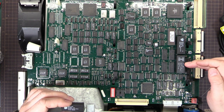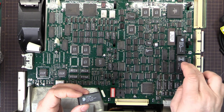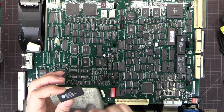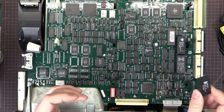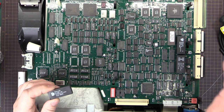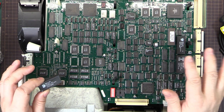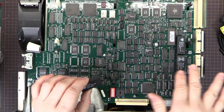Then there's the DS-1650Y — that's just battery-backed SRAM — and the DS-1250Y. The 1250 and 1650 are pin-compatible; the only difference is the 1650 can write-protect individual parts of the memory. I don't think Tektronix scopes use that feature. I've found both the 1250 and 1650Ys used interchangeably in these scopes — they just used whatever was cheapest at the time. But be careful with other equipment; they may need the 1650Y for locking calibration constants. If anyone knows whether the TDS 500, 600, or 700 series actually uses that function, let me know.